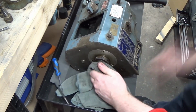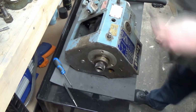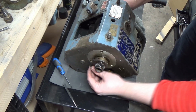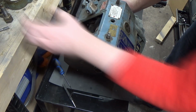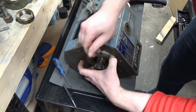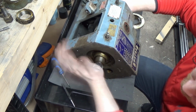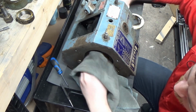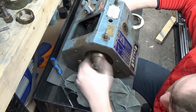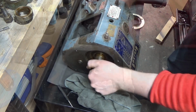And you'll see I take the back gear action apart. You've got a bar that sits on a pivot point, and that's what engages and disengages the back gear. You'll see it on the top there. So I'll take all that apart first, then I end up pulling the back gears themselves out, and then we get to hitting the spindle out, which was a bit of a task. It probably took a little bit longer because I wasn't giving it full pelt with the piece of wood and the hammer, just because I didn't want to damage anything. But regardless, it was quite a lengthy process.